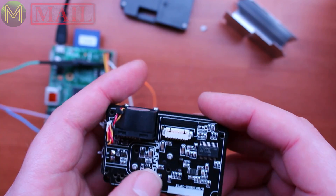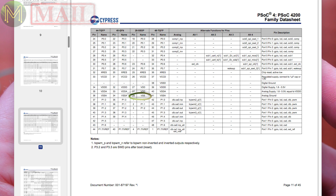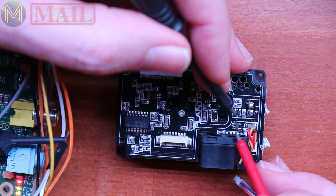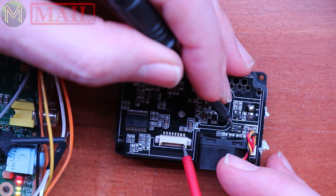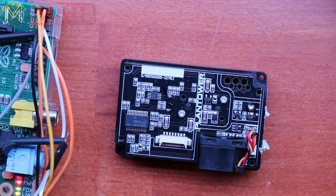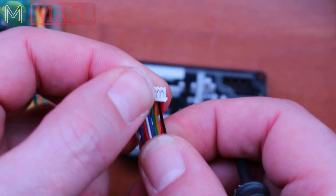Let's find out if my assumption was correct and that the five-volt and ground were connected up properly. I looked at the datasheet — pin 28 of this package is ground and pin 27 is VCC. I buzzed it out: this one is ground, correct. And this is a 5V to 3.3V converter. What they've done is wired it around incorrectly — the cable goes like this, but it should be like this. It's all wired up correctly now with VCC, ground, transmit, receive and so forth. The fan is running now — it's in continuous scanning mode with pin 3 connected to VCC.